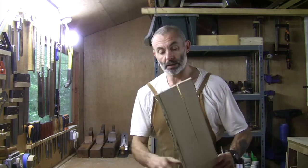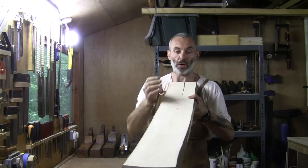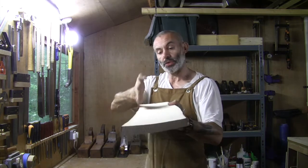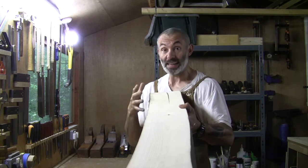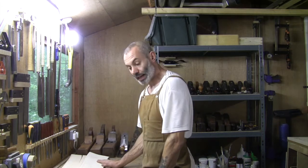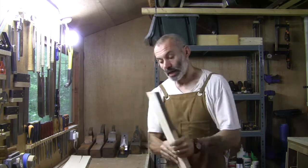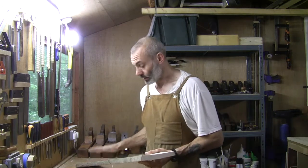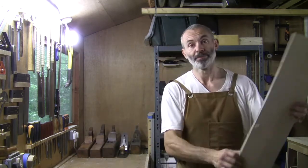So what I'm gonna do, I'm gonna saw again, this time by hand, all the way across to get an edge and pieces. Needless to say, flattening this, if you split it in more than one piece, you may actually lose less of the wood. So you can see that I need about five of these boards, so I should have just about enough. And let's hope that. Now I will start to saw the pieces, and then I'm going to flatten one face first and then start to flatten one edge, and then all the other faces will follow.